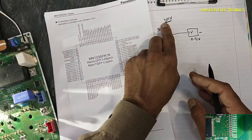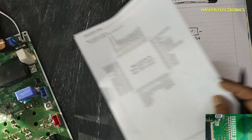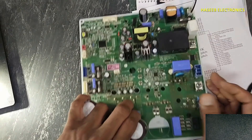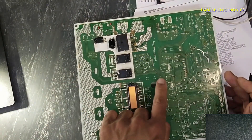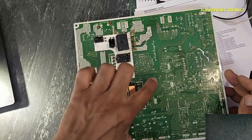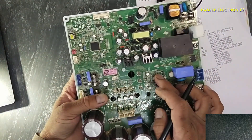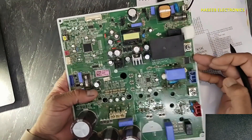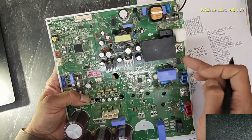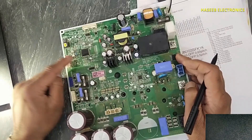Based on this voltage reading, the next instruction set in the program defines the next function. For example, if the voltage drops below 280 volts, the microcontroller will start its inverter section and PFC section. It will provide commands to turn on the PFC IC. Same time, it will enable other ICs and monitor for overcurrent. It will monitor the voltage and communicate with the outer world using these optocouplers.